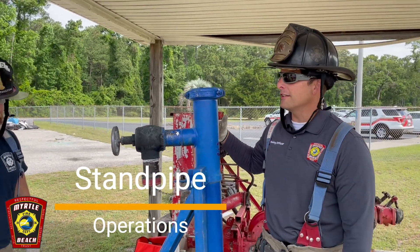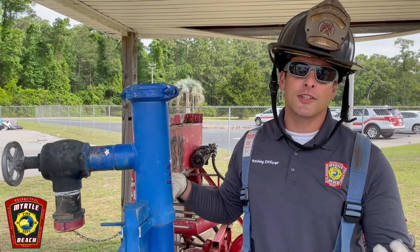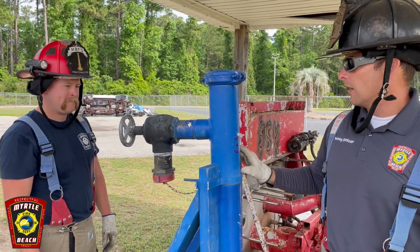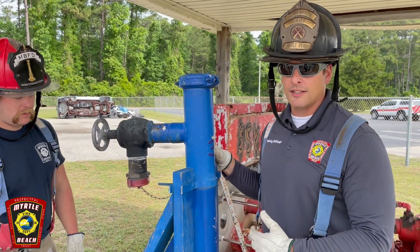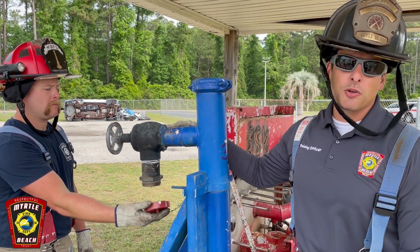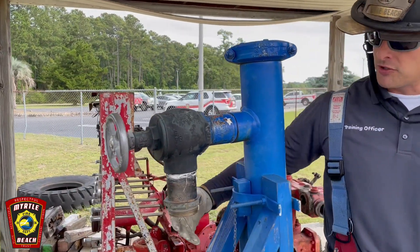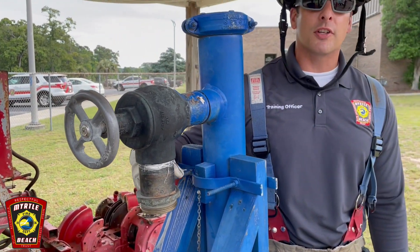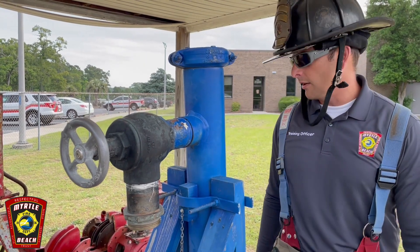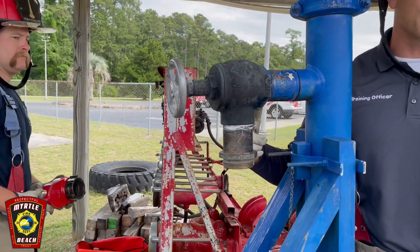I'm here with Lieutenant Whittington and we're at our standpipe outlet prop. We're going to go through the ideal setup in the best-case scenario. This is a Type 1 or Class 1 outlet — a two and a half inch discharge. Lieutenant Whittington will act as either the driver operator or whoever is assigned to make the connections to the outlet. This is a conventional valve — we know this because there's nothing on the outlet indicating a PRD, no device to hamper opening the hand wheel, and there are threads inside the outlet showing it's not a pressure-reducing or restricting valve. So we're expecting pretty decent pressures. First thing he wants to do is get his gate valve out of his kit and make a connection prior to flushing — this is super important, because sediment and debris can develop in the piping.